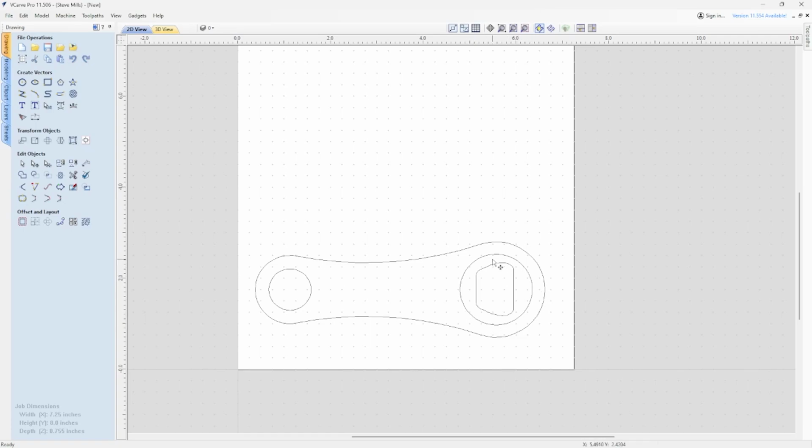But over here, it's more important. We have that round cutout. That's going to be a shallow pocket, about 0.08 inches for the metal plate. And then the pocket that's going to go behind the metal plate that allows you to get the bottle opener in there. So what we can do is we can actually replicate this.